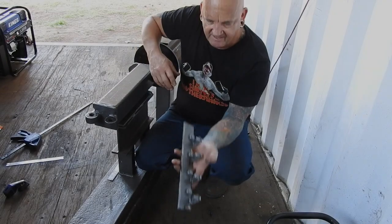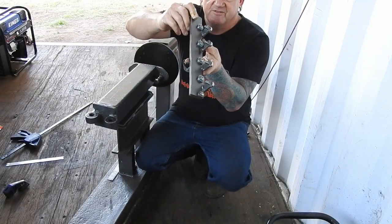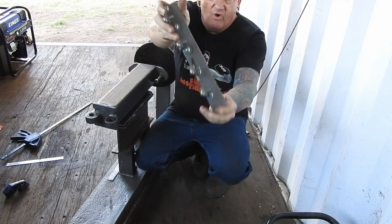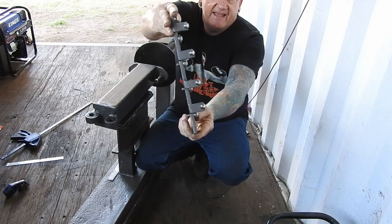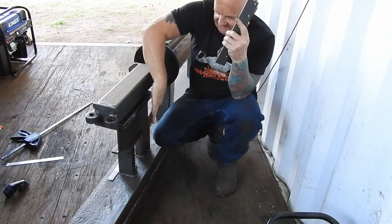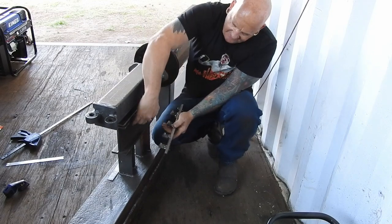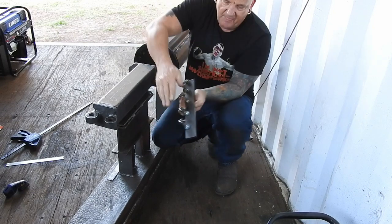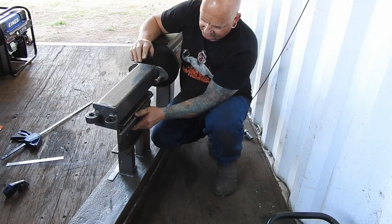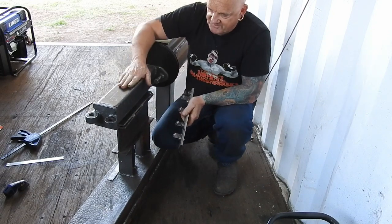I've made a new piece just here, which is a 10mm steel bar with bearings all the way along that way and that way, which equates to in here, so this is mounted as such. These bearings will hit the underside, and those bearings hit the girder, so this will slide up and down like this — no worries with the hammer.